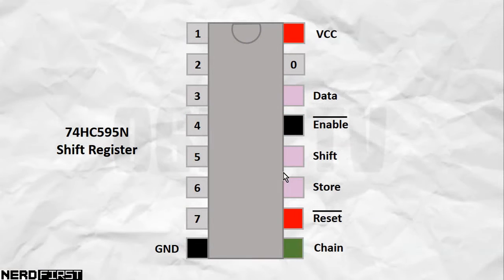This is a representation of our shift register. Probably the only thing you need to take note of is that there are several pins we don't normally talk about: namely the enable and reset pins. These have to be connected, otherwise the chip won't work properly, and that is one reason why the whole connection can look quite messy. Notice that these pins have a little line above their names - that means in order to get that functionality you need to bring that line down to low. That is why this pin goes low (because we want it enabled), but this one is high (because we don't want to keep resetting our chip).